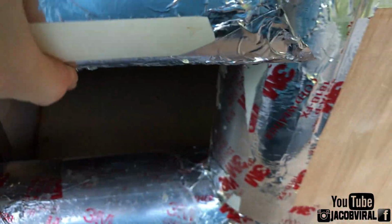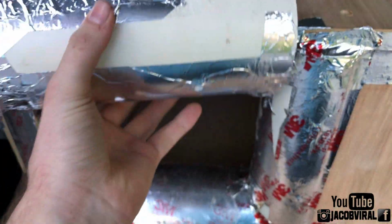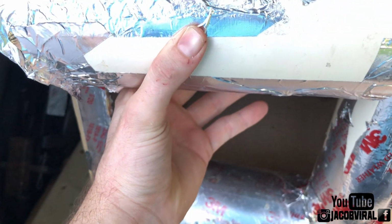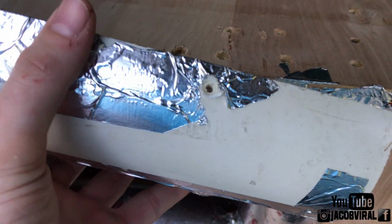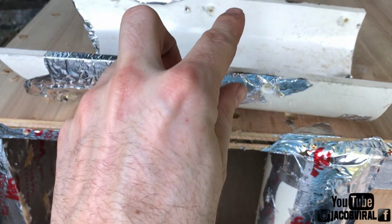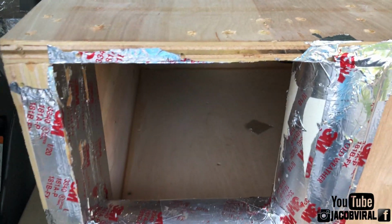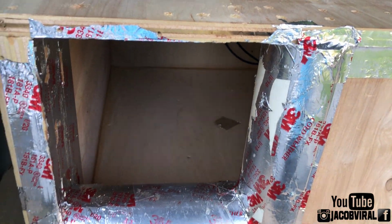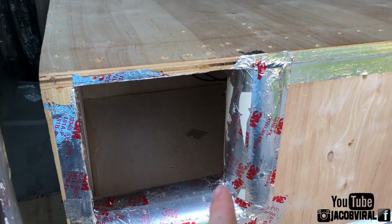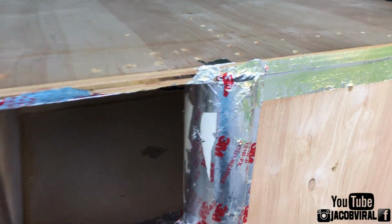I could do something where it would round over on a smaller scale. So instead of the depth being down, I can go up a little bit on depth. So I'll cut some of this part off of it, and then that would raise my lip up slightly, and that would cause my port height to be slightly lower. That could be tenths that you can gain, but every tenth counts. So if I gain, let's say, 0.2 just by lifting that up, that's a little bit of gain.